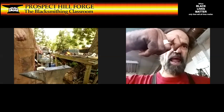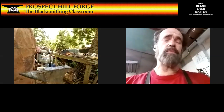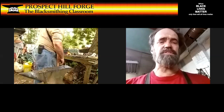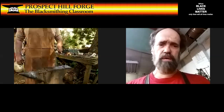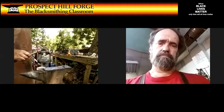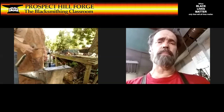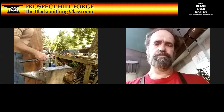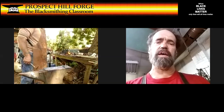Okay. And then hammer straight back in with, ideally, a very light hammer. Because you don't want something that outmasses the actual work. This little one, or I may have something lighter. If you've got something lighter, awesome. For lighter, I end up in a claw hammer. Yeah, okay. At some point, you'll make a lighter hammer. Either of those will work. Okay, cool. But yeah, it's a very light, snappy hit. First, you're going to bend it just the tiniest bit over the edge.